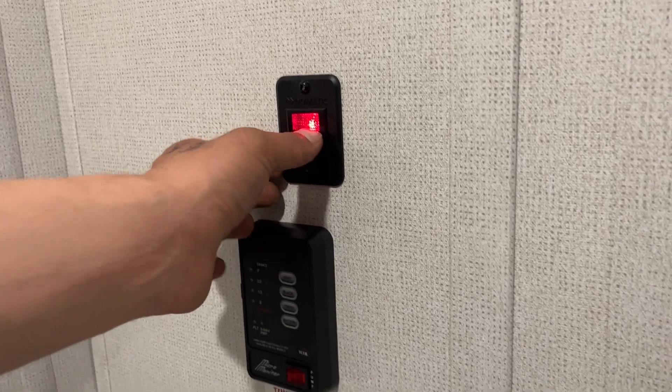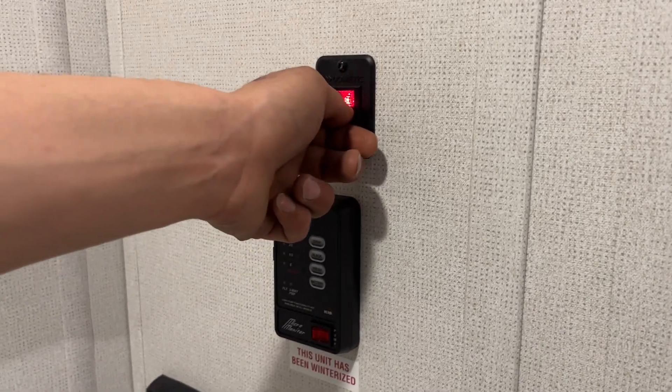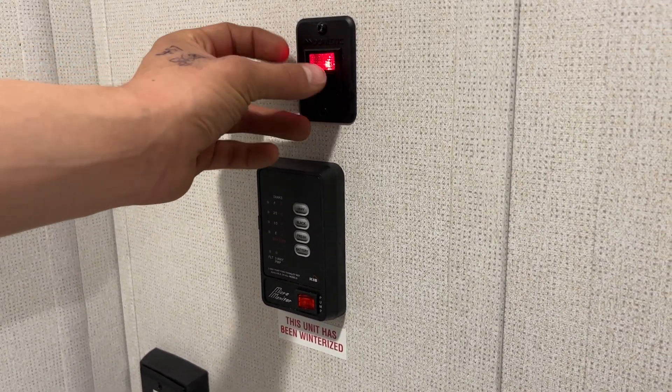Into the bathroom. The light switch is just on the right there. The toilet flips open and you get your flusher front and center. The hot water tank control is here — just turn that switch on and you get a little red light letting you know the ignition sequence will start. Once that sequence has started, the light will go out. It'll try three times. If after the third try it doesn't fire up, the light will come on and stay on — at that point, just turn it off and back on to reset it.